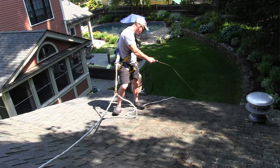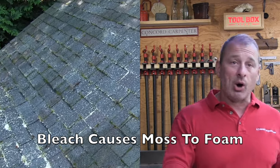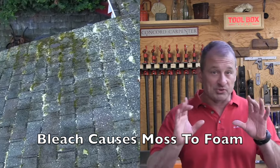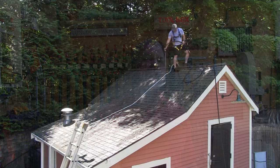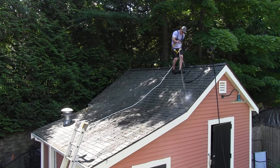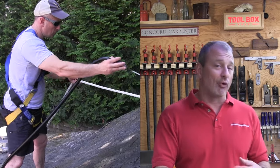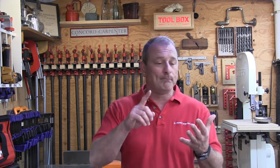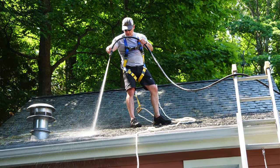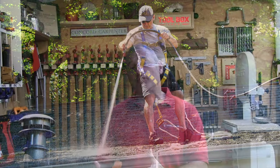Here's how you do it. Get yourself a garden pump sprayer and mix up a 50-50 solution, then spray it onto the moss and shingles — I spray the whole roof, but mostly the moss. Give it 15 to 20 minutes to soak in. Then rinse it thoroughly with low-pressure water, not a pressure washer. You might find you have to reapply the solution — I usually reapply twice before hitting it with a hose. Make sure you protect landscaping and anything on the runoff at the roof's edge: plants, window boxes, things like that. Never use a pressure washer, as it can damage the asphalt roof and cause premature loss of granules.